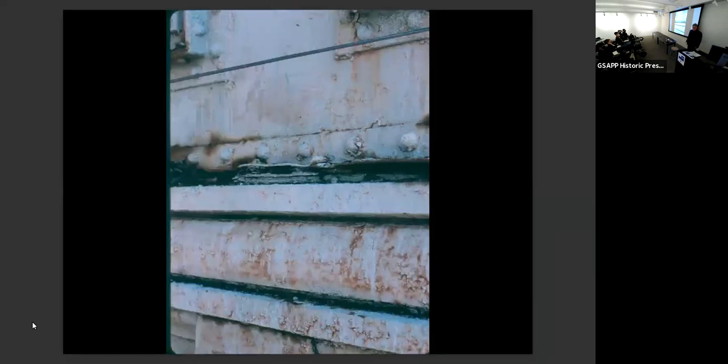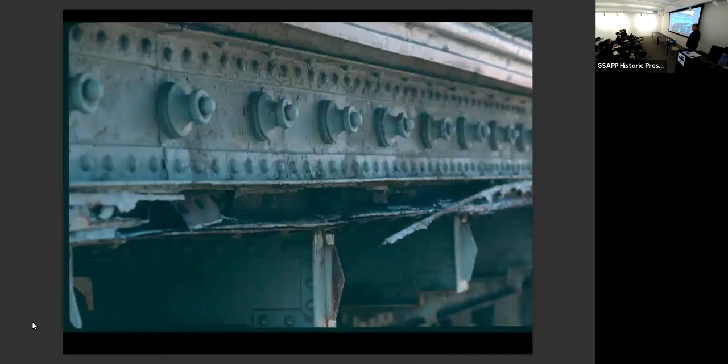So that young woman, Deirdre, asked me, how am I going to tell what everything is? I said, okay, all right, Deirdre, if it's steel, it pack rusts, makes a little kind of a phyllo dough of rust, and then just disintegrates, especially on this building, which hasn't been attended to. I said, so you're going to find a lot of deterioration like this that if you look at it carefully, you'll understand what it was. In other cases, you'll have pieces that are obviously so deteriorated that it can't be anything else.